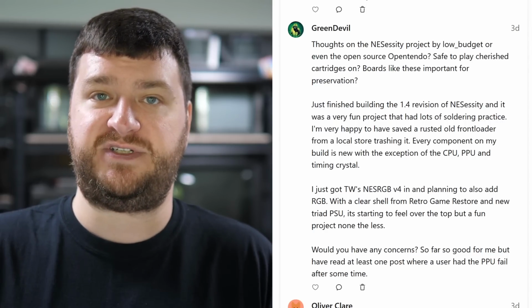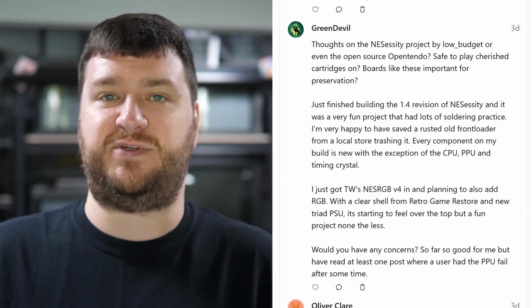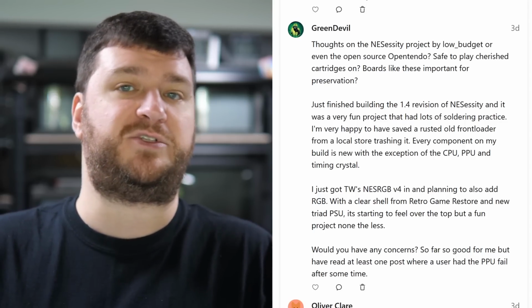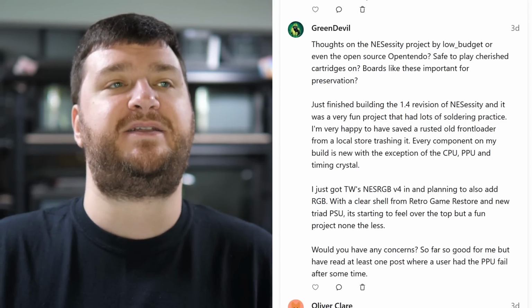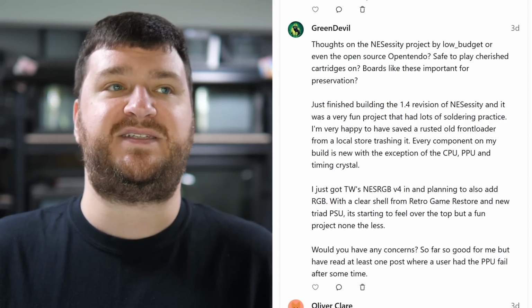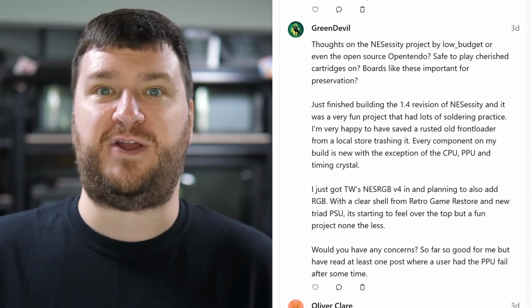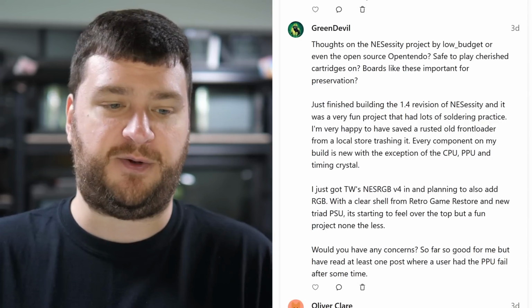As long as the voltage is the same and the cartridge slot connector that you used isn't one of the crazy ones with the death grip, or if it's flopping around in there, I would say that it's completely safe to use. Just double check the voltages because everybody makes mistakes. And I cannot tell you how many times in my life I've put a 750 ohm resistor where a 75 ohm was supposed to go, powered it on, and got no video, and I start freaking out and realize, oh, I used the wrong resistor. So just double check your work.